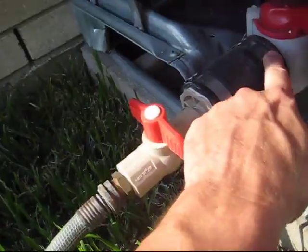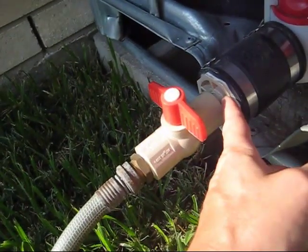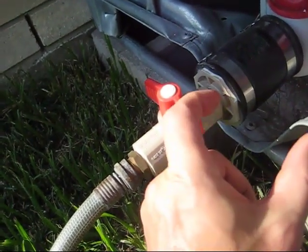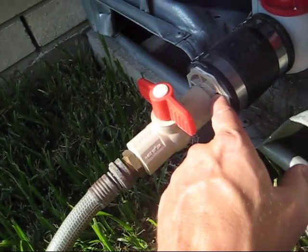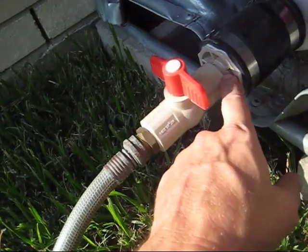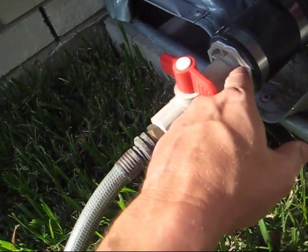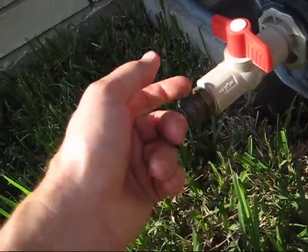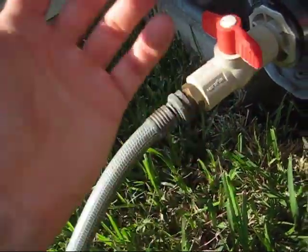To make it easiest, I would clamp this on here first, slide this in, clamp that on, and use some Teflon tape. Wrap it around the small threaded 3-quarter-inch PVC — it's probably a couple inches. Then thread this on, and as you thread this on, that'll tighten that pipe up. Then put some Teflon tape on here, tighten that on — you probably need to hold this while you tighten — and then you're good to go.